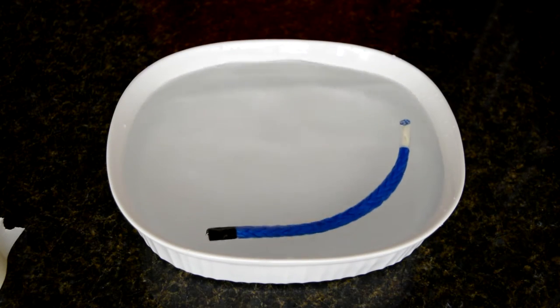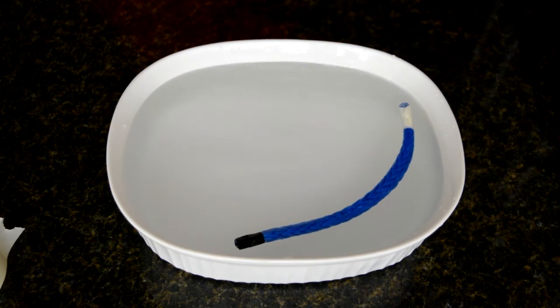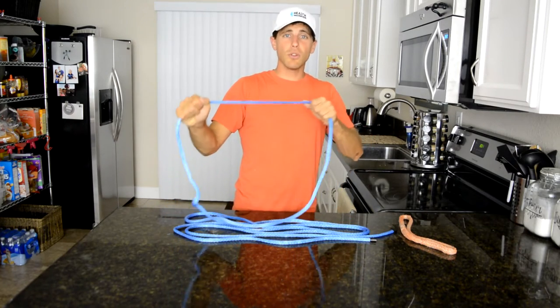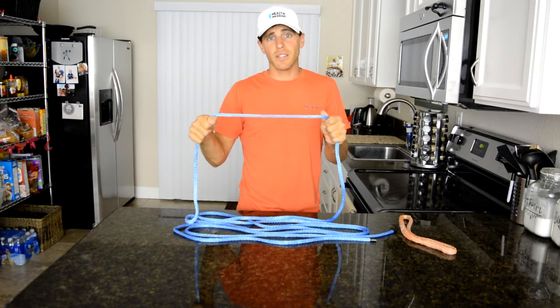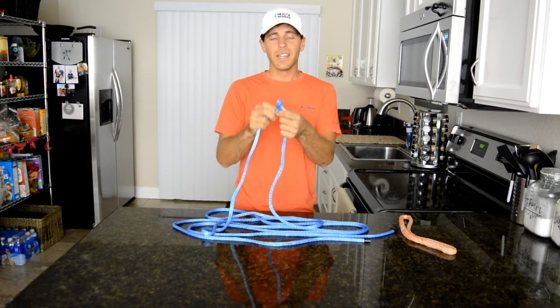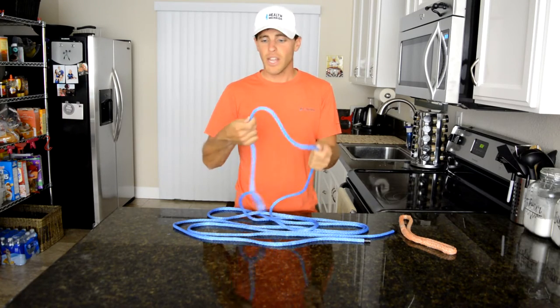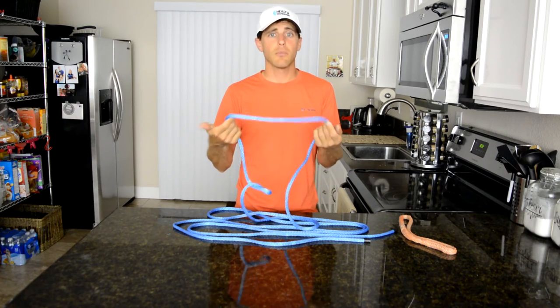This rope is 8 times lighter than steel cable, and yet stronger than steel cable of the exact same diameter. It floats on water, which is why it probably has so many marine applications. If you pull it really hard, it almost stretches 1% — it's extremely static. If it breaks, it doesn't whiplash like a steel cable, which made for a gruesome opening scene in Ghost Ship. It doesn't kink, it doesn't rust, it's extremely flexible, and you don't get any wire splinters from Amsteel.